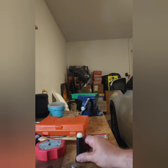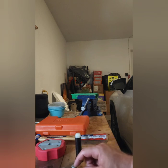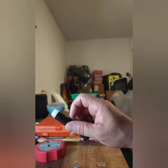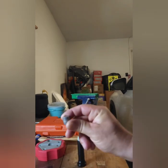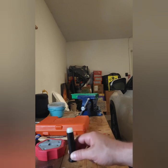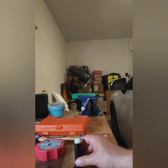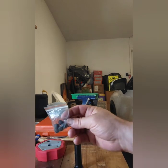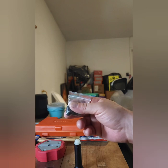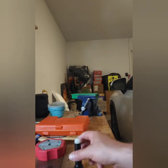That's an ounce and a half more than a standard carbine buffer — it was an H2 buffer, which weighs about four and a half ounces. What I did was take the roll pin out of the buffer and drop one of the weights out, which removed an ounce and a half and brought the buffer weight down to exactly three ounces. For the empty space so I didn't have clacking noise, I inserted just some earbud gels from old dead earbuds. I've got a bunch of these laying around — jam them down in there and they take up that space.